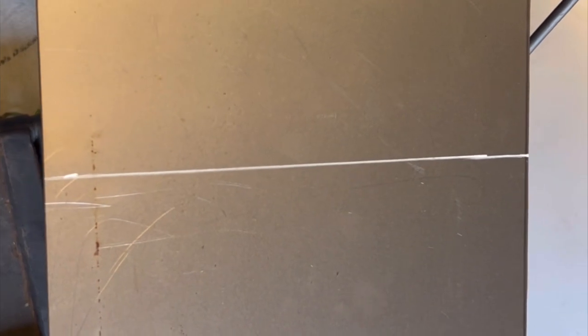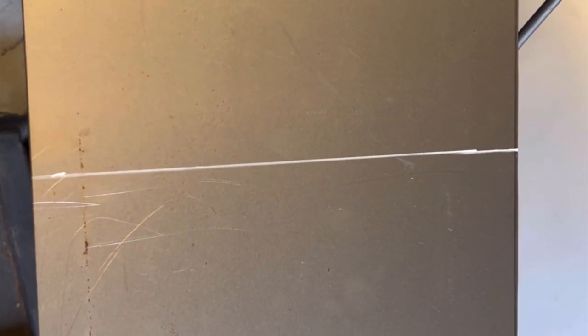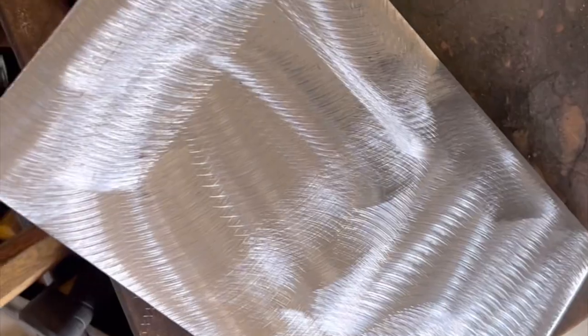So I've gone ahead and marked 2 6-inch sections and we'll get the plasma cutter and we'll slice those out. So guys, we got them cut out and just cleaned up. Get a quick one too with the grinder. So what we're going to do is we're going to mark them and I'll show you how we're going to bend them into place, okay?